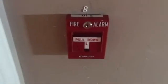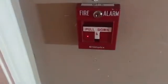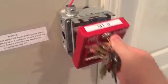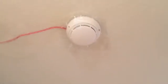Red LED came on — let's do the next one. Next up is the storage area, called the storeroom in the panel programming. Spraying that detector — hope it doesn't set off the residential smoke alarm we have over there. There it is. Next up is the basement stairway pull station. There it is. Next up is the upstairs hallway pull station — there we go.